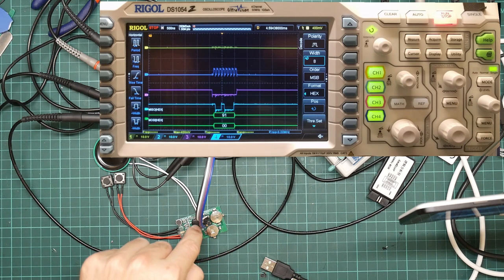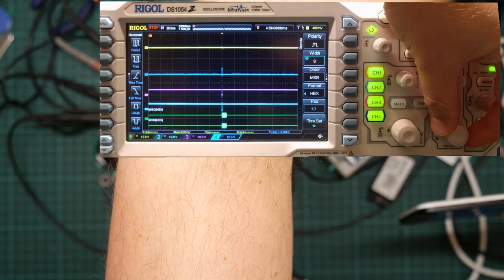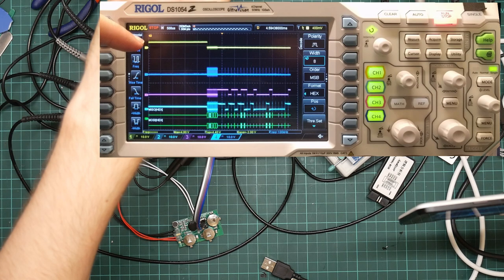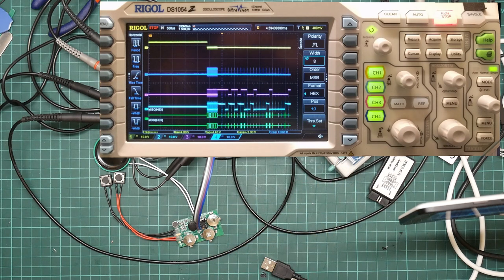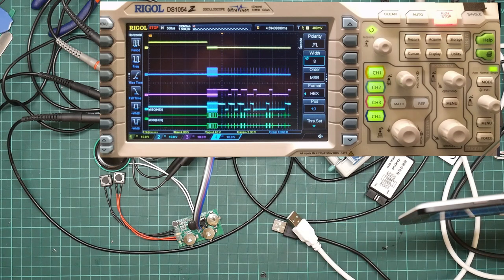I think that the flash chip here is holding the chip select line deasserted, that is high. That will, let me zoom all the way out. So high means off, and I think it's providing more power to keep it high than the EEPROM reader is supplying to lower it. Therefore, the flash chip is never waking up, and this thing is never seeing any data. So the next step is to get out the laptop again and plug in the EEPROM programmer.